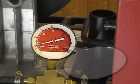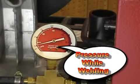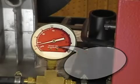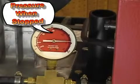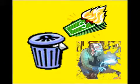When welding, the pressure in the gas delivery hose varies from three to seven psi. When welding stops, the pressure increases to the regulator pressure, which could be up to 80 psi. This stores up to seven times the amount of gas as the physical hose volume. The stored gas blasts out of the MIG gun nozzle when welding starts. The high gas surge not only wastes considerable gas — in some applications over half the gas used is wasted.